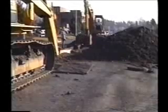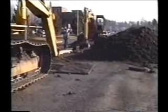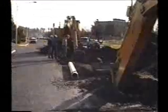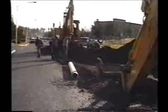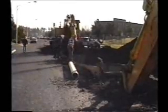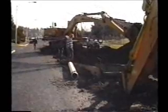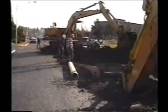To avoid future costly and time-consuming cave-ins, the compaction bucket would build up material before the trench box was relocated. By following closely behind pipe-laying activities, the compaction bucket keeps a minimum of trench open. This increases safety and reduces the possibility of cave-ins.